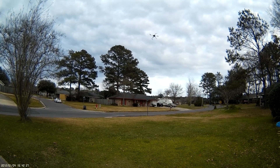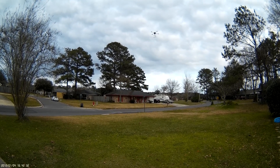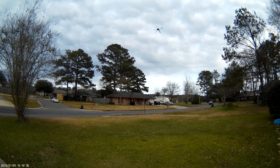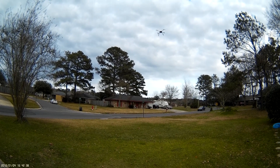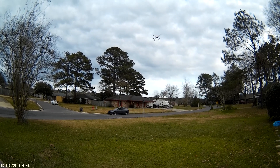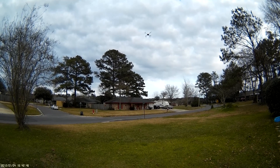I would think that is a bad compass calibration. We also have a status LED out on the arms — I just noticed. That thing's just going to keep turning, so the compass is not calibrated. In this case I'm going to fly around a little bit.